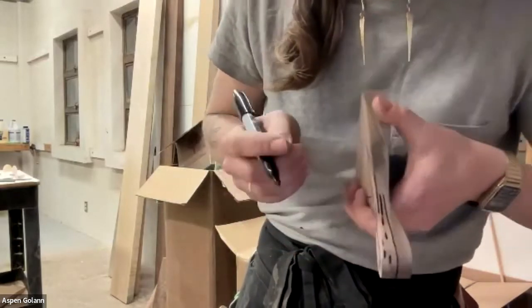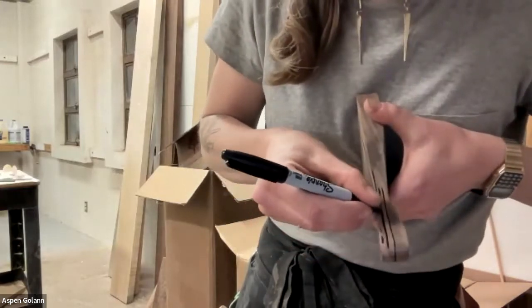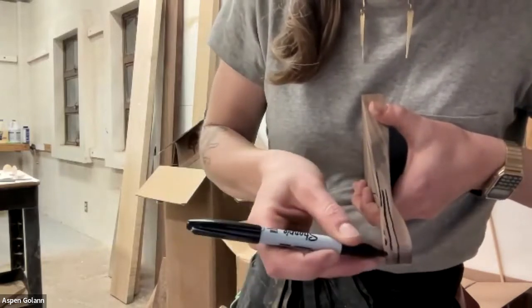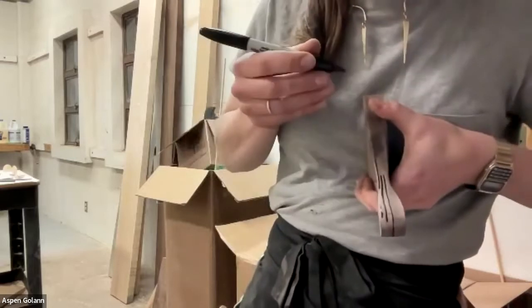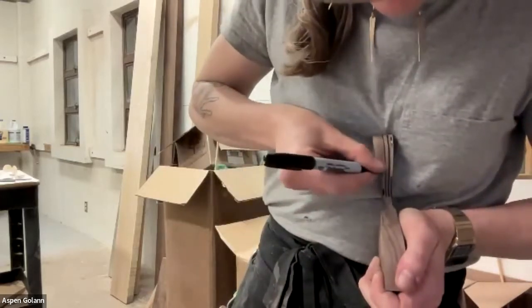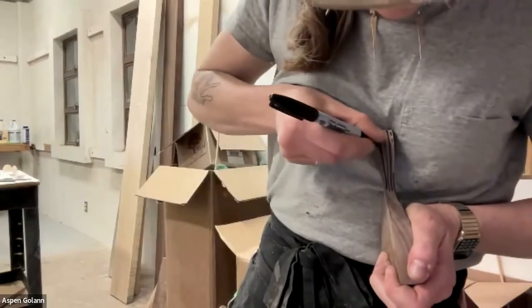And because it's a more complicated line, I like to make tick marks and then connect them. So I'll split up 5-7 in one spot and then in another spot and then another spot and then evenly connect them all. It's easier for me that way. You can see just how little wood we're going to be taking out of that neck area.